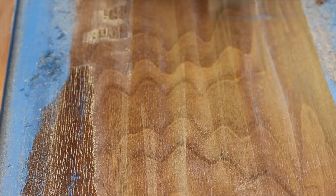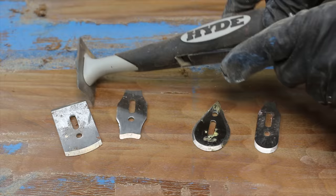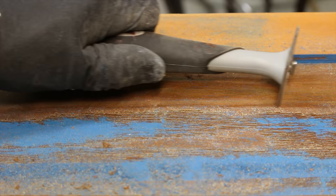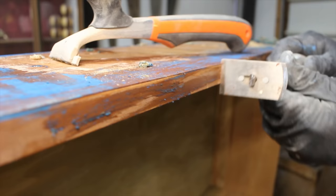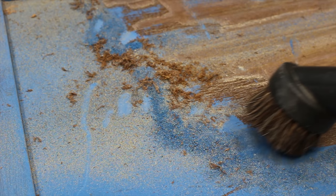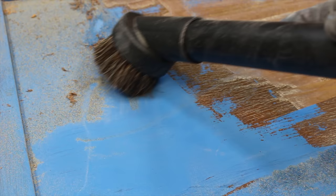To help put things in perspective, using a carbide scraper like this for an entire project can be labor intensive. However, it can be quicker and much cleaner than using any chemicals. The cost for a good quality carbide scraper that I use for most of my projects is about $25 on Amazon. And for the detailed scraper set, you can typically find a set for under $15. At the moment, the cost of one quart of paint stripper at the big box store is around $19, and this probably would not even be enough for this single project.